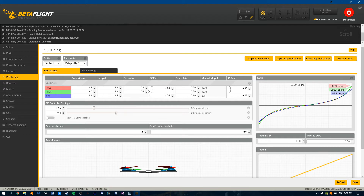If you decrease your D gains, you can learn to fly away from prop wash so your quad feels a lot better and you don't have the issues of prop wash. That's just my opinion, but to each their own. For I, I tune out the bobble you get from throttle movements with anti-gravity gain, so I just throw my I's to 50 and 45, and I've never had an issue with that.